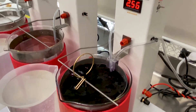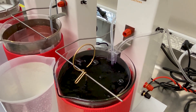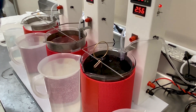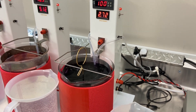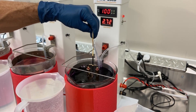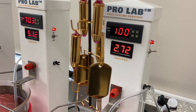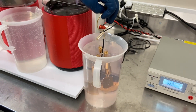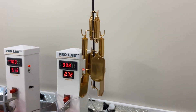If I were plating a jewelry-grade thickness on these, I would plate them for three to five minutes. For something like the 44 Magnum cartridge key tag, where you'd want really heavy gold, you could plate that for 10, 15, or 20 minutes to really put the gold on thick. It's probably been long enough to get a good decorative coat. We'll pull it off the titanium bus bar — and you can see, although they have the purple solution on them, they definitely have a nice layer of 24 karat gold on there. We'll take them in with a rinse. I hope they look as good on the video as they do in person, because they look great.